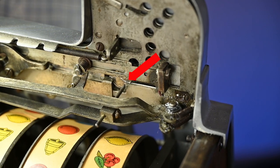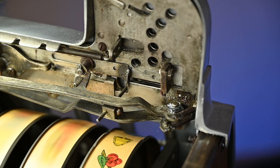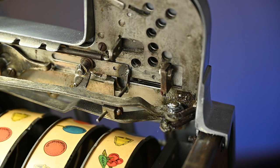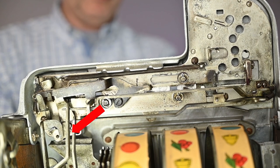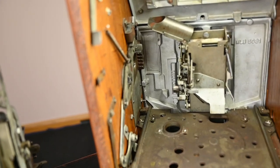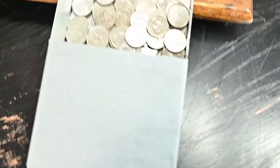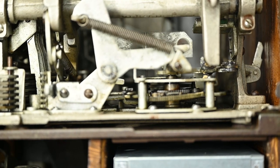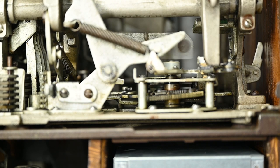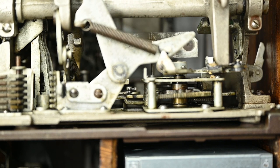As I pull the handle, a rod pokes forward and if it meets resistance the handle is allowed to continue and the whole mechanism is launched. At the end of the escalator, the quarter drops down a chute. Here's the long brass coin chute that fills up for paying out. When this chute is full, coins spill over into one of the jackpot reservoirs — either the one showing in front or the backup one behind. When all of those are full, the coins spill over and down into the removable cash box. When you pull the handle, that's what sends the reels spinning. At the same time it winds up a mainspring, also called a clock, and that unwinding clock is used to regulate the speed at which the reels are stopped, starting from the left one at a time.